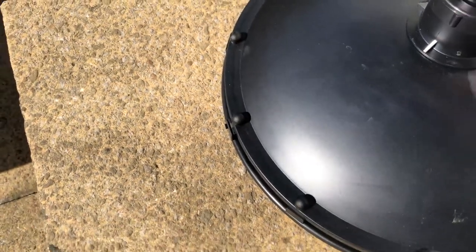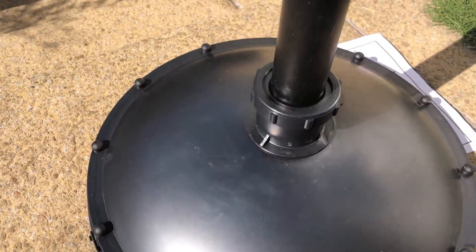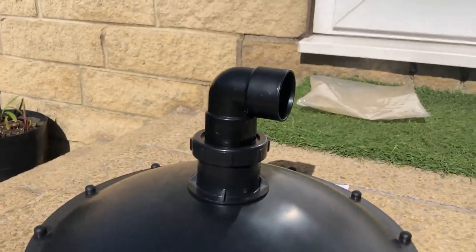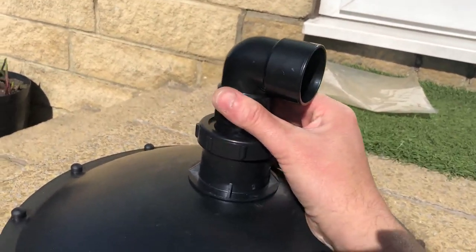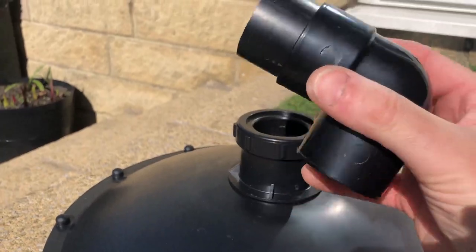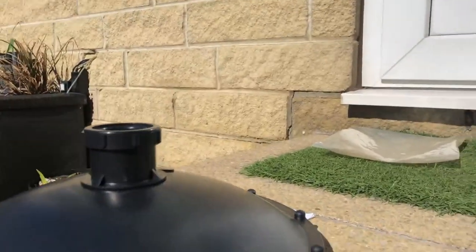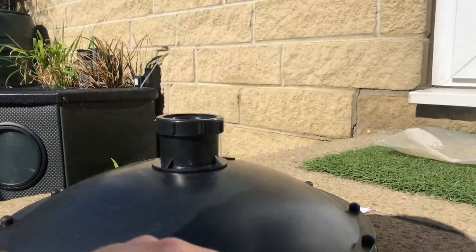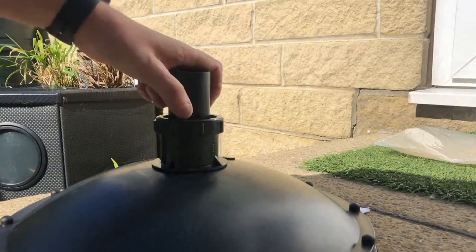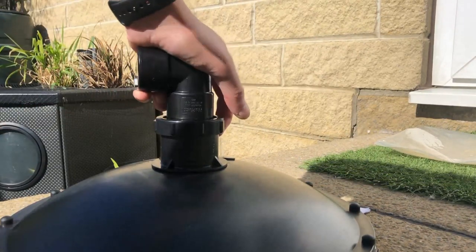So now, all we need to do is make this bit. Let me get a pipe cutter, and we'll get to it. Right, guys, there we go. There's a little piece of pipe into the elbow. Now, I can show you. To make sure that I got it exactly the right length, I cut this pipe, dropped it in, pushed it over.